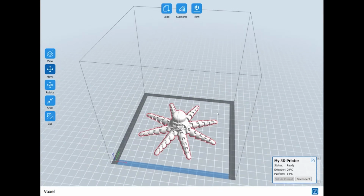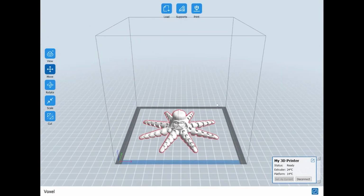and in this software, I should be able to go ahead and print this and send it straight over to the printer. So I'm going to attempt that right now by hitting print. It will print when slice is done, so I can just auto set that. It is going to be the Voxel. I do not have ABS in there. I have PLA. It does not need to print any kind of supports or anything like that. I do like printing with a raft or with the adhesion if you're using Cura. And we're just going to print this standard.